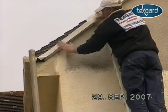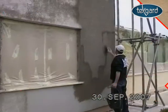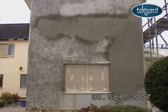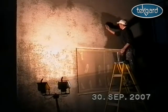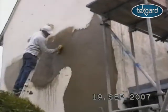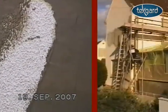Because the existing surface is textured, these repairs will have to be feathered in. Here, you can see the bagging method being used, a mixture of sand, cement, and a PVA adhesive. Because all customers' deadlines are to be met, we are equipped to work into the night. We do our utmost to stay on schedule. If the bagging system won't suffice with regards to feathering in, then we use a Tyrolean gun, as this will add a more viscous material.